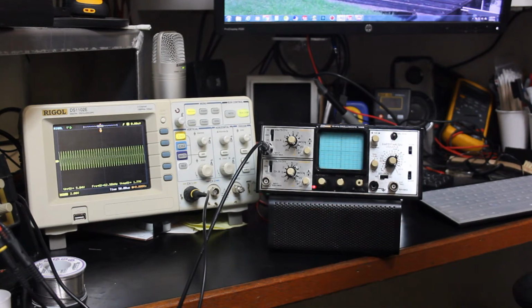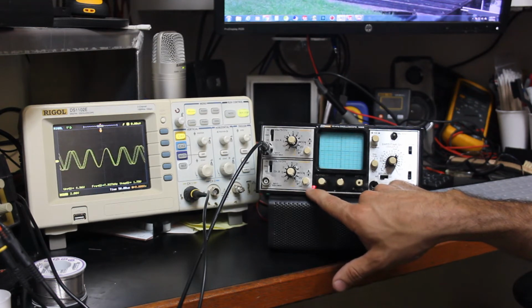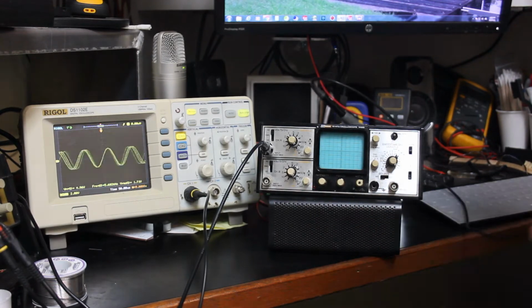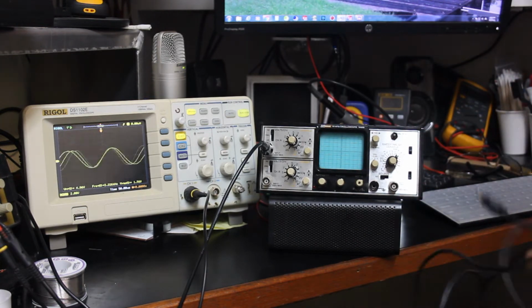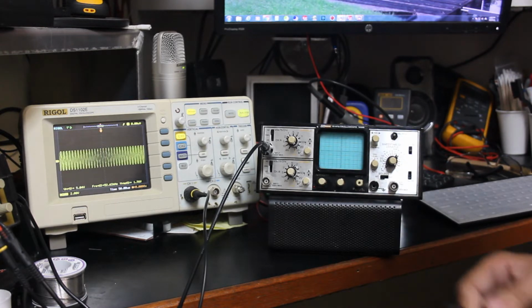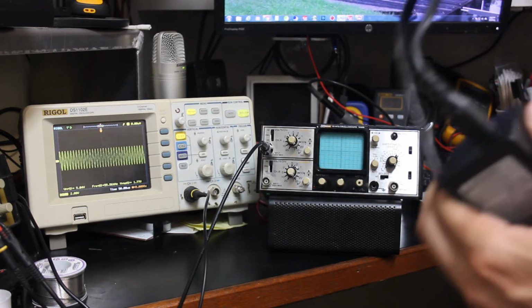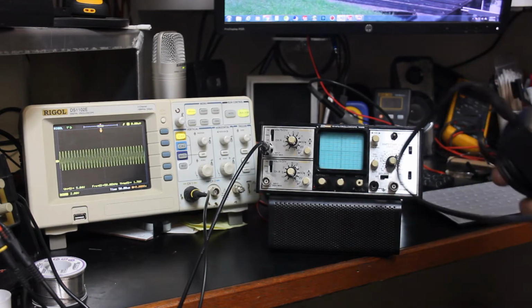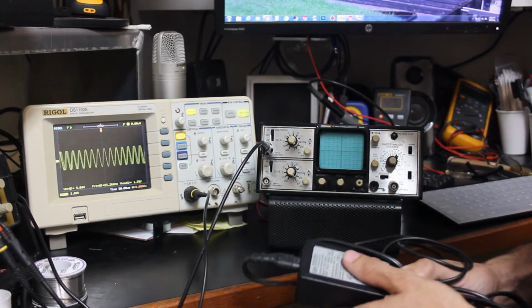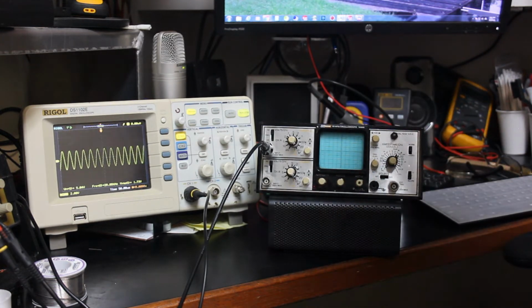We do have our red light. It takes a minute for these CRTs to warm up. Of course, it should already be warm. Oh, what was that? Look at this. Our power indicator is actually blinking. So that's interesting. It seems like our little plug-in power supply here could either be broken or it could be not enough. But I mean, it's a 12 volt DC 2 amp. It does feel a little warm. So I'm just wondering if we don't have a power supply problem too. Because it runs just fine off the external supply. So if our power supply isn't working well, because I was getting slightly under 12 volts out of it before, that kind of gives us another opportunity to work with this thing.